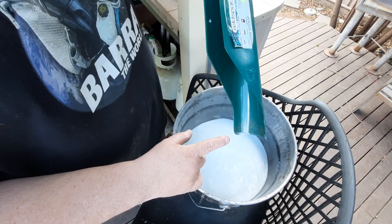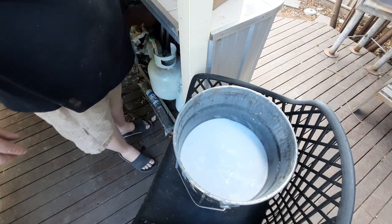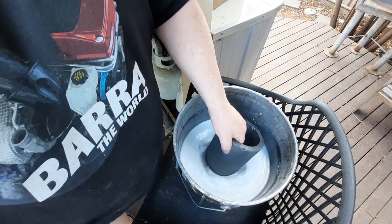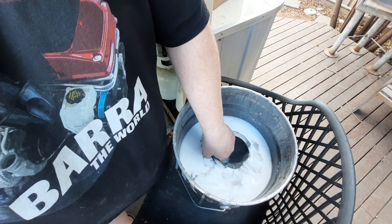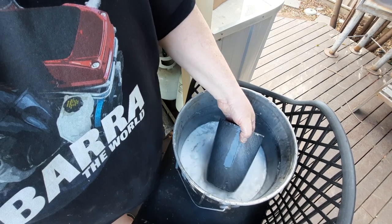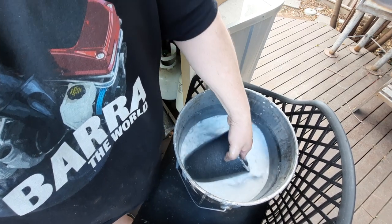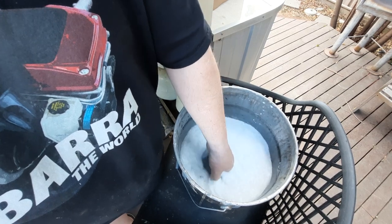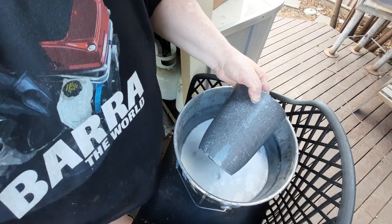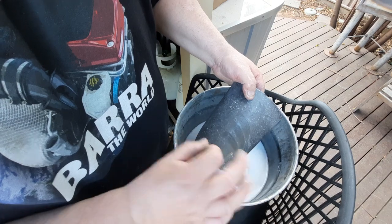You can see there are tiny little particles - that should soak into the crucible. So if we get the first crucible out - this feels wrong, I know - but it will soak into it. You just want to give it a little douse, soak it in there. Then this is actually going to dry naturally by itself. You can see some of it's gone in the cracks like that - we don't want to touch it and wipe it off, just want to leave it.